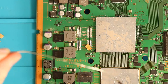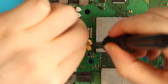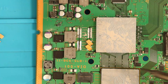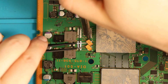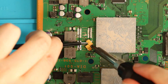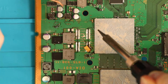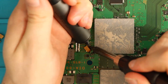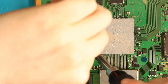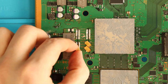This part of the video was extremely fiddly. The capacitors were actually a little bigger than I thought, so you have to angle them at like 65 degrees — though that's probably completely wrong. The brown stripes had to go on the top row, and I believe the bottom row is ground. I had to use some solder braid to soak up excess solder on the board, and that didn't go too well, but eventually things got moving and the more I'd done, the easier it got.